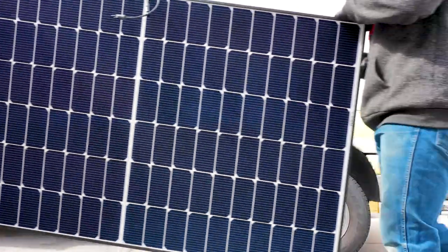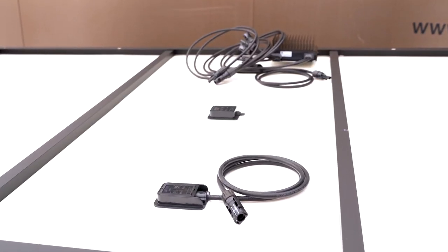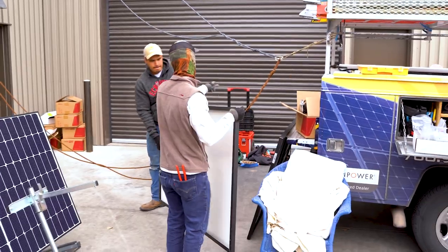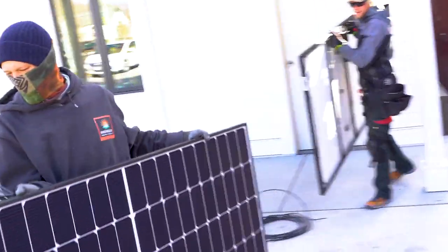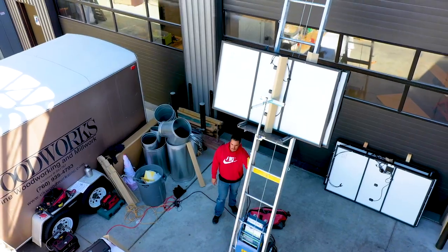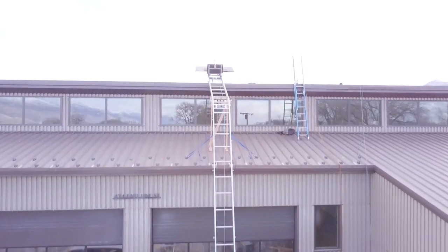On this project we got to meet and hang out with the guys from Berger Solar. They used a dual optimizer on this project. Here we are on the ground getting things pre-laid out, figuring out where those optimizers need to be, what lengths the leads need to be, where we need our clips, and tidying up the modules so that when we get up on the roof it just clips right into place. We went up on the roof first to confirm the right layout, and then doing this stuff on the ground is a huge time saver. Mark your modules, know what order they're in, have them on your map so you know where your optimizers are — it's a really clean way to do it and keeps everything in order.